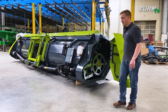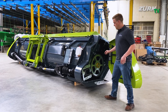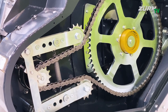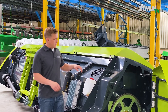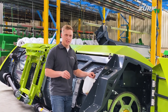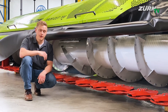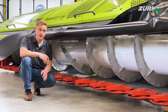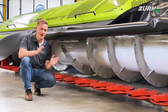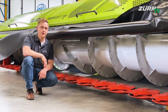When we now open the right hand side door we can see the massive auger drive. The automatic chain tensioner keeps the chain tension correct even when reversed. To ensure a high wear life, this automatic lubrication system permanently adds some oil to the chain. In the ProfiCut we have a massive 800mm auger with high auger flights to handle even large throughputs and feed them to the chopper evenly.